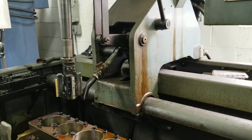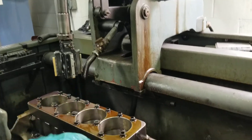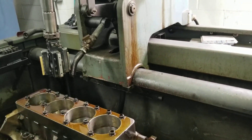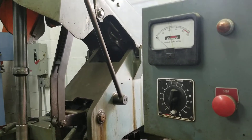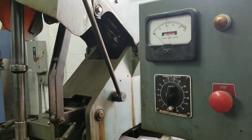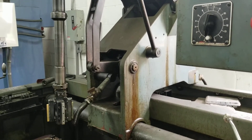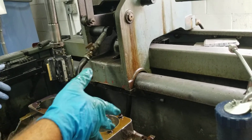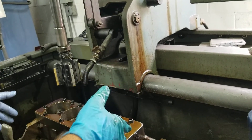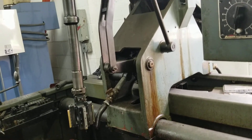And we like to see that. When you know what you're doing, it's not too complicated to get it to that. Many would say, "Oh my god, that's really ridiculous to try and keep a cylinder within one tenth or two tenths of a thou." It's not. When you know what you're doing and you know how to fix certain areas by dwelling the machine in a certain area or setting up the height of the block in a given area, you can achieve those figures without issue.